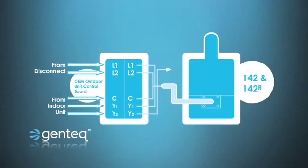If we do have 24 volts going to the motor and we've already confirmed that we have high voltage going to the motor, then the motor has failed — there really can be no other problem. So it's a very simple motor to troubleshoot, but you will need the manufacturer's schematics, which may either be in the outdoor unit or in the OEM manual.